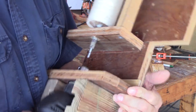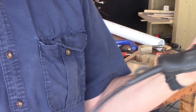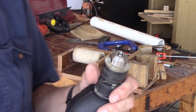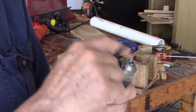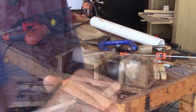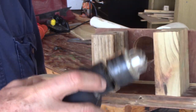For this drill-powered sander I found this — it's a Harbor Freight drill, a Warrior. It was $22.95, on sale for $17. It doesn't have variable speed but it does have reversing and it has a keyed chuck, which is important. I've done this sander with a hand-tightening chuck and it just won't stay tightened for very long. So I wanted a keyed chuck so I could tighten it down and have it stay. At 17 bucks it's basically just a motor to power my sander. It comes with a handle that goes around the collar, which makes a perfect grip for my sander — I can cut a hole here the exact size for this collar nose.